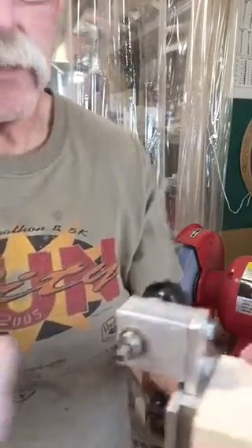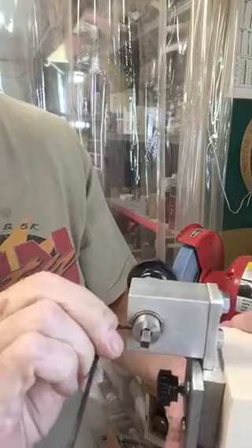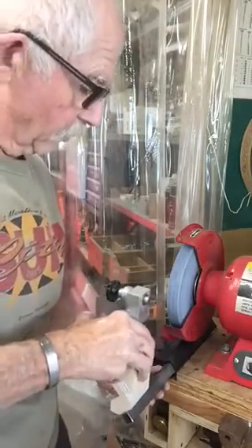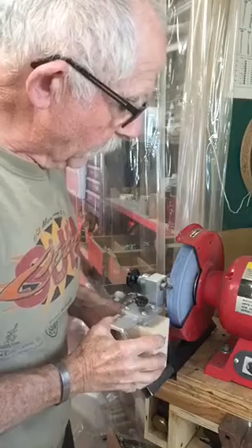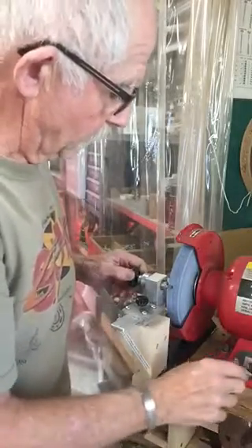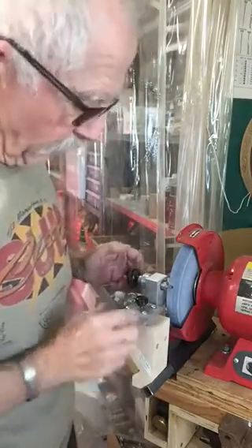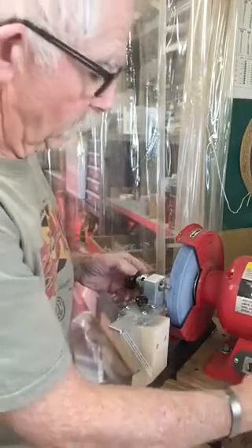Once we get this piece of steel in there and ready to go, I snug up the set screws with an Allen key. This now goes — slides into the socket on the Wolverine base, and I'm bringing that piece of tool steel up pretty close to my grinding wheel. I'm going to turn the grinder on now; it's going to make a little noise and throw a few sparks. I'll just slide this piece back and forth, use my fingers as kind of a guide and a grip, rotate this, and we're going to grind a round profile on this bit. Here we go.